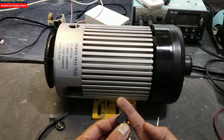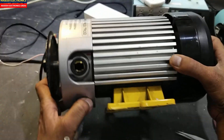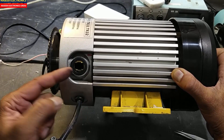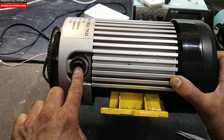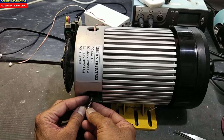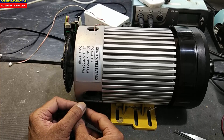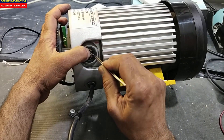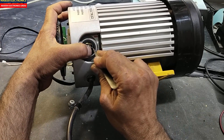If the carbon brushes are about 70% worn out, we need to replace them. Then we need to clean the commutator and inspect it. If it has too much carbon on the commutator, it needs to be cleaned — disassemble the motor and clean it thoroughly. If there is an intersegment short, that must be removed. That short circuit comes from the carbon; if its length is not within limit, it is shortened, and short length will cause sparking with the commutator.